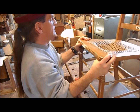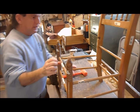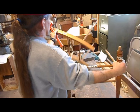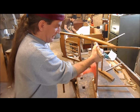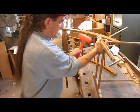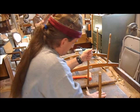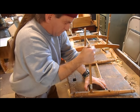You don't really want to brutalize these things by taking them apart. You really want to take them apart as carefully as you can, but sometimes you do need to use a lot of force. We try to separate the front from the back and just gently separate the pieces. If gentle doesn't work and you have to use a little bit of force, try to use as much as you have to, but you don't really want to brutalize the chairs. Sometimes a stubborn joint helps if you give it a little wiggle to loosen them up.